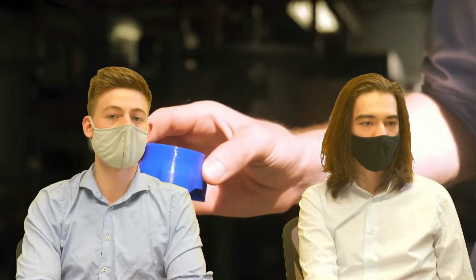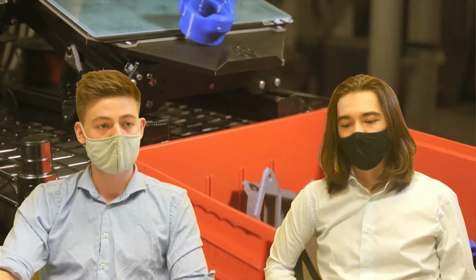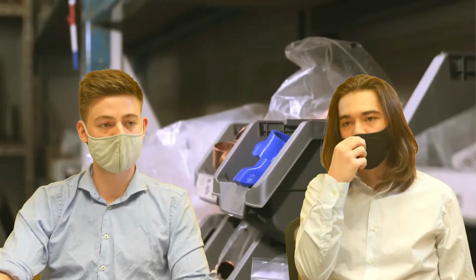What do we do in software when we launch a new beta for a printer? Sure. I guess the design philosophy for Quinley software is a bit different than other printer hosts in the sense that we try to make it as configuration free as possible. When you hook up your printer to Quinley, you don't have to go through a whole bunch of menus and select exactly what your printer does and doesn't have enabled. Quinley will support it if it is enabled, or deactivate it if it's not. So if you have a printer with filament out, if the filament out is there, Quinley will know to look for that and work around that.